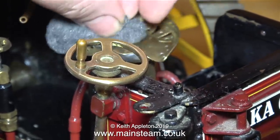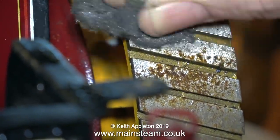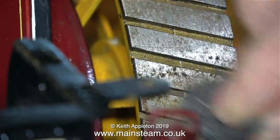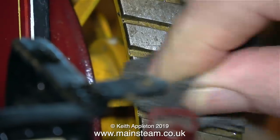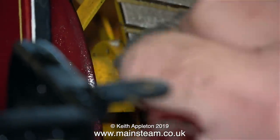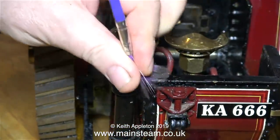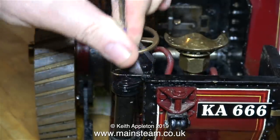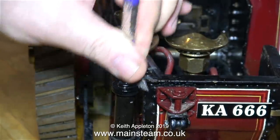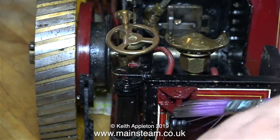In this clip I'm using the wire wool to clean some brass parts, and here I'm trying the same piece of wire wool to clean the wheel which is rusty. The fine wire wool is cleaning off the rust but it's really difficult and it took a long time. I think 400-grit wet-and-dry sandpaper would be better for this job. Here I'm using the same principle as before — holding the bristles near the end to stiffen up the brush — and this really does remove the more stubborn dirt.